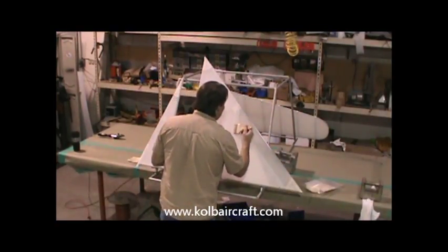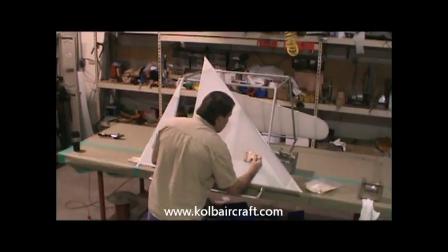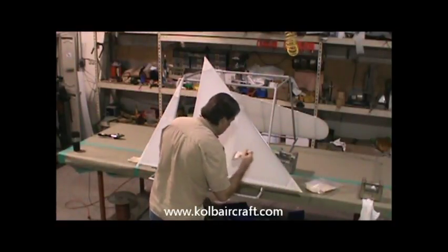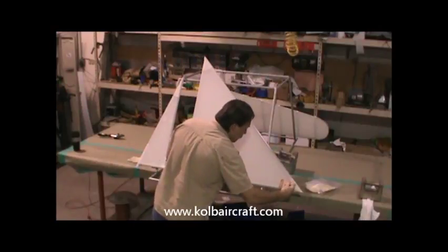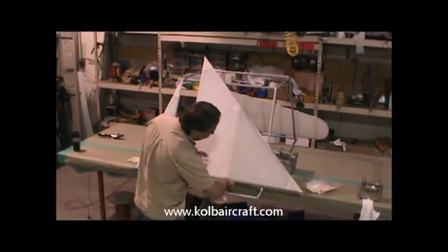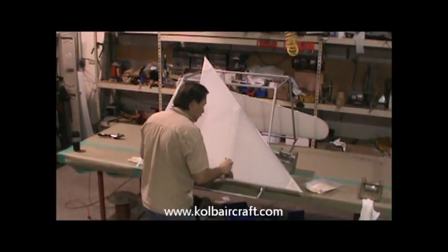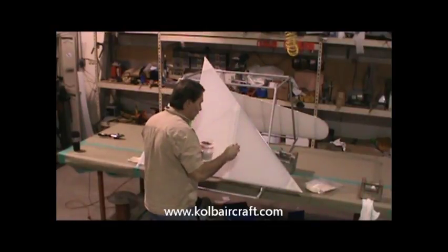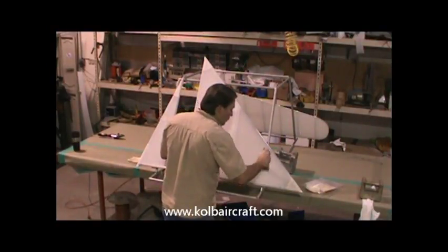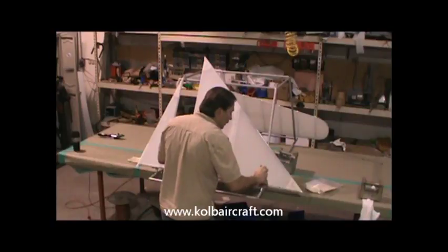And what I like to do after I get that first part cut in, is I just come from the middle over, just like that. And then you can see that soaking through, running down the inside, and finishing out a nice clean seam right there. And after we brush that from side to side, we can just go ahead and dry our brush out. Start out on the side that we started our brush run from, so that we can get some of the excess off of there. You've got to move along pretty quick with this, because you do not want it to start setting up before you finish getting everything smoothed out the way you want it.